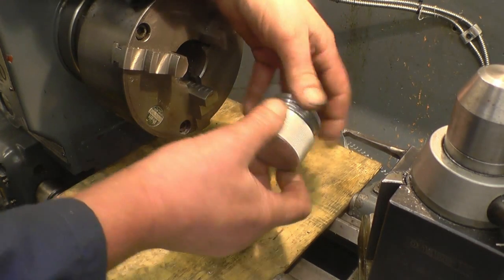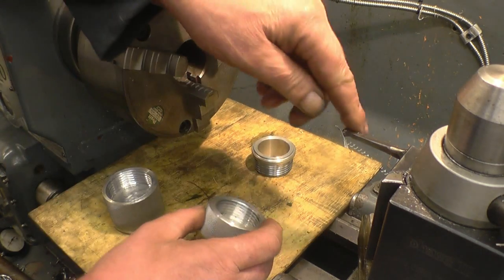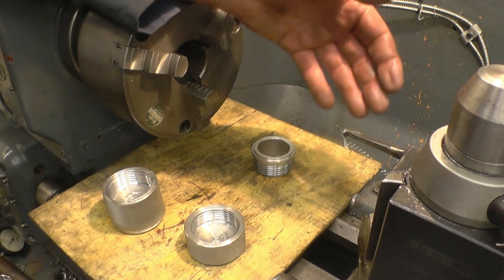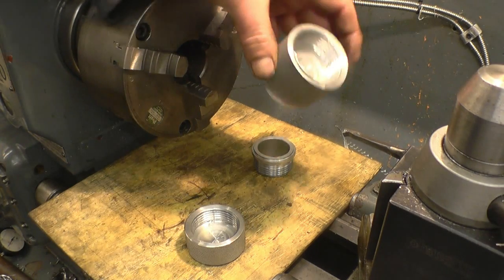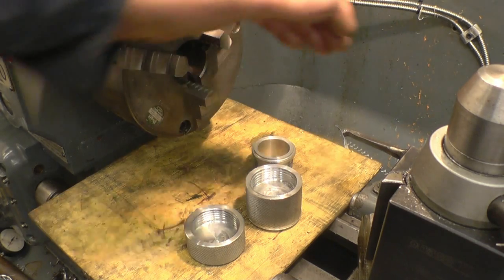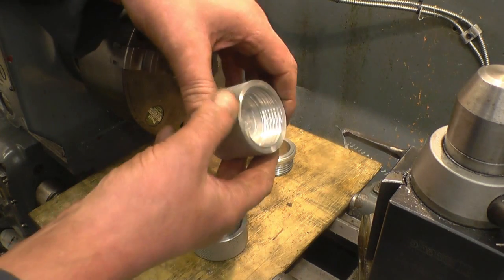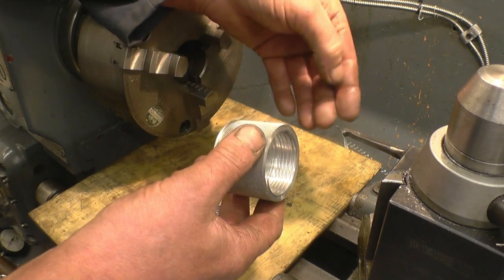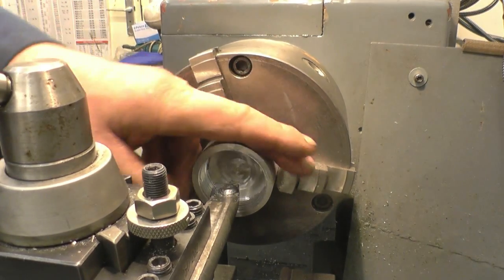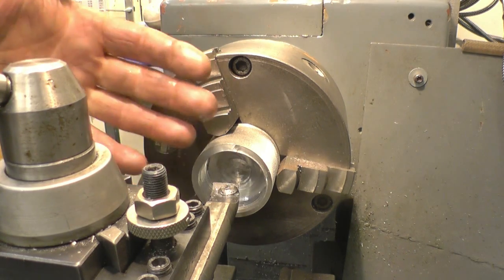This is the oil filler cap I machined in last week's video. That's the one I machined in the video before with the wrong-hand thread on. I machined this oil cap by screw cutting from the outside going in and then stopping on the recess. One or two people mentioned that you can screw cut with a tool upside down, the lathe running backwards, going from the inside out. It's right — you can do that and you will also get a right-hand thread. So before I clean the lathe I'll turn the threads out and remachine it just to show how that tool works upside down cutting the right-hand thread. I've got the left-hand thread one mounted on the lathe — I want to bore the threads out, put a groove in the back, and then show you how the tool works upside down.